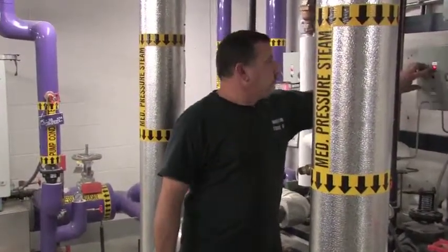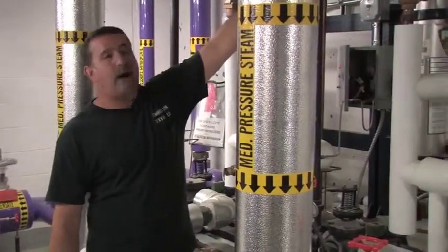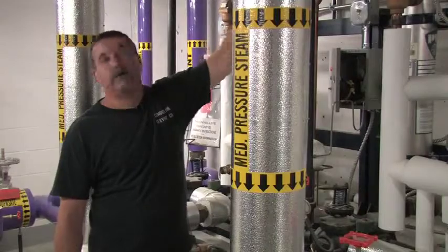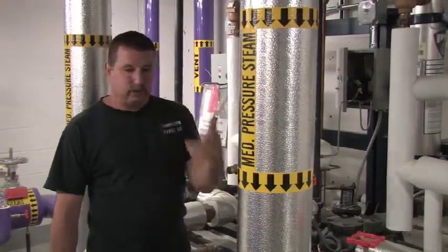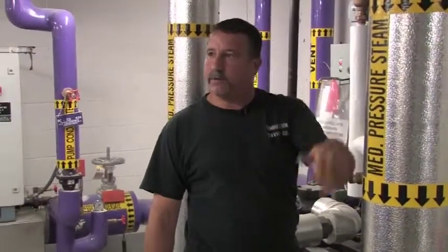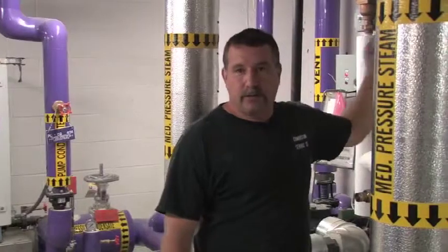The only other thing we have is a subcooler light, and all that's indicating is that we have power to our stratification circulator, and that's what they're calling a subcooler. All that's doing is going from the hot outlet to the cold inlet and maintaining a minimum flow. And that's just indicating that our circulator is powered and functioning. That's really all there is to it.